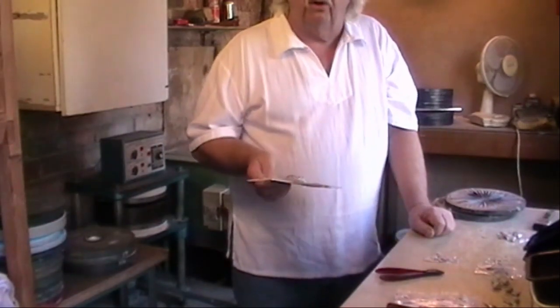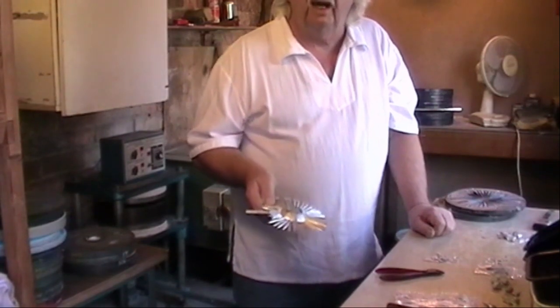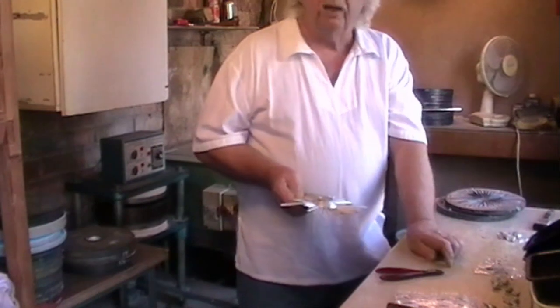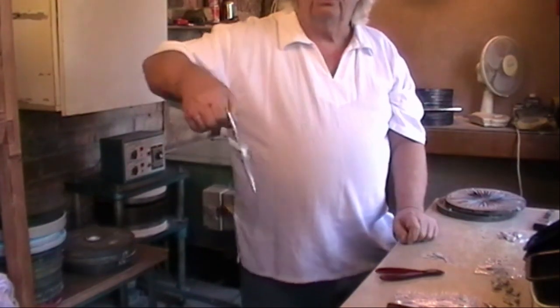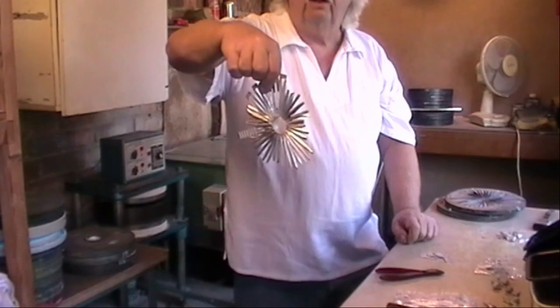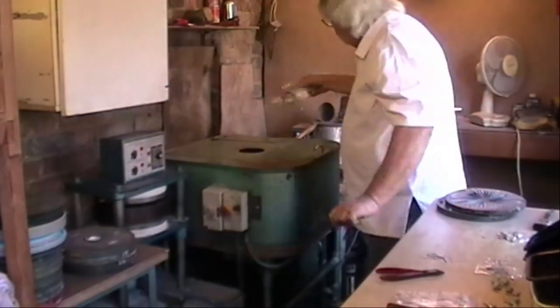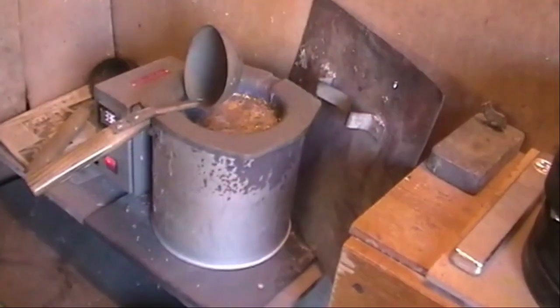One that I did earlier, and that was the saw bench, and what I've done is taken it out and I've just broken off the bits and put it on the table. So what you've got left now is, you can see where all the spokes went between each master in the mould, and that bit goes back in the pot. Melt pot.